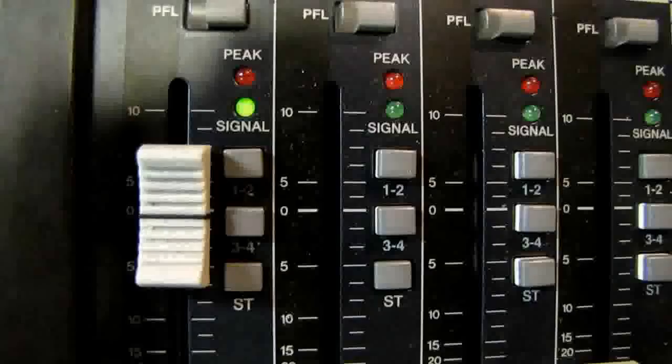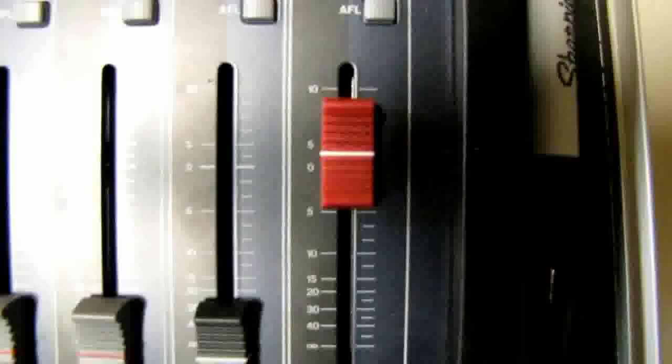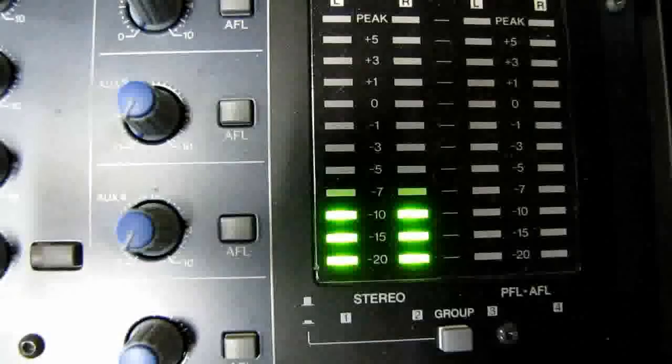The slider positions used in this example are for illustrative purposes only. You should never slide a slider up to 0 dB unless you know specifically what you are doing and what level you are setting. Just because it's 0 doesn't mean that's where it needs to be. The master fader can be set at 0 dB, but care should be taken to understand how you are running your system and how much power you're pushing. Please take note of the meters on whatever system you're using — more than likely they can tell you more about what's going on than what you can feel and hear. Thanks for watching.